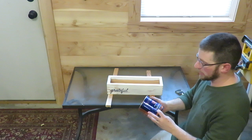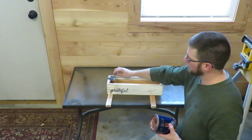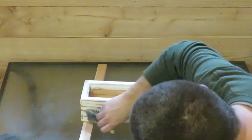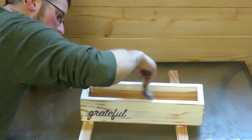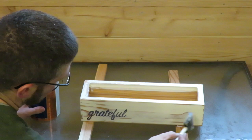I'm using some Valspar Signature clear protection, just putting a clear protector over all of it to seal it up nice. I'm going to do two coats and I definitely recommend using a foam brush. One thing you should do first is wipe it down with a damp rag and let it dry to make sure you get all the dust off. Do one coat, let it dry, and go back and do a second one. Once you know you've got a good first coat on, go around and check for any drips or lines, wipe them down and even them out, then let it dry and give it a second coat.